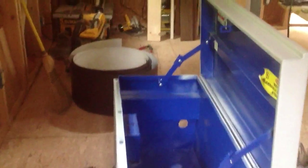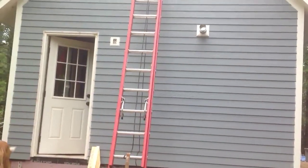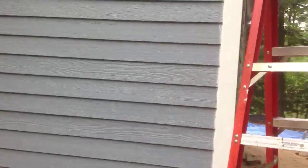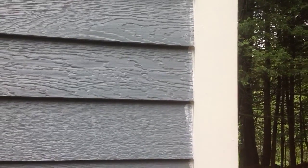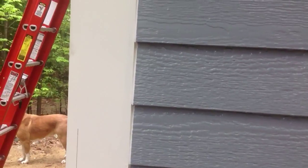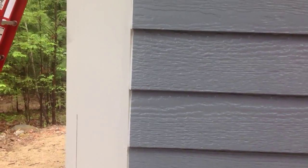Let's go out the back door. There's the back of the house — this has not been painted with the second coat yet. Here's a good detail: LP SmartSide wants the joints to be caulked. That joint right there is actually a lot more work than you'd expect — I used probably ten tubes of caulk to do this house, and it's not a very big house. Here's what it looks like finished up. I cut right to the edge using a foam roller — one of those little disposable foam brushes. Wasn't too bad at all.